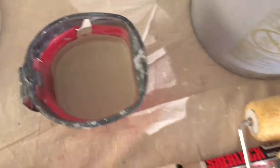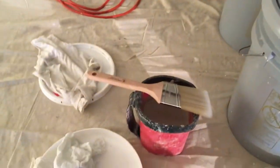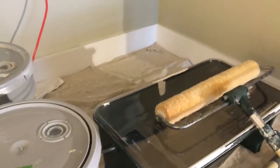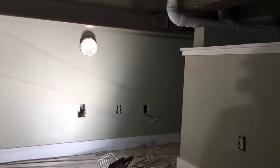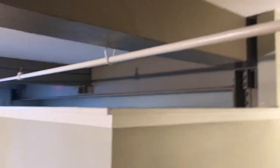I've got a wet rag here for my hand, a liner, and then here's the bottom of a bucket I cut off with some damp rags and a bunch of dry rags. That's how I like to set up when I'm going by myself - just literally have everything in my arsenal so that even if there's a wall where it'd be nice to have an 18 and I only have a 9, I don't have to suffer through and waste an extra 10-15 minutes. Those minutes add up - waste 15 minutes four times and there's an hour. The time goes fast, especially on rental properties. You've got cleaners coming behind you, floor guys behind them, property managers on your case.